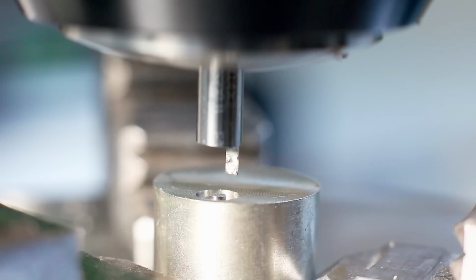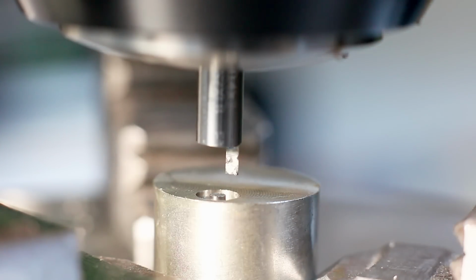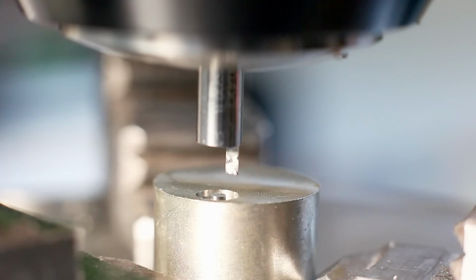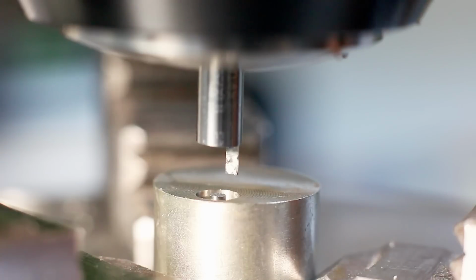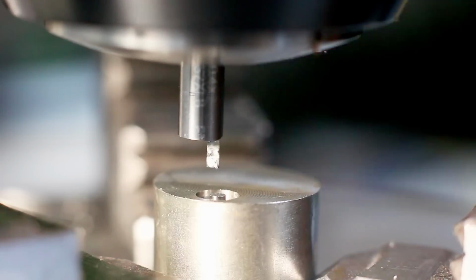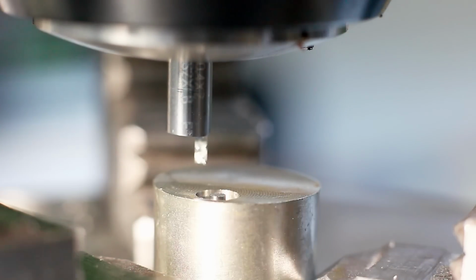This power feed is 10 microns per revolution, and to my liking is almost too fast. Unfortunately, that's the slowest feed this machine allows. But as you saw, it does a really nice job of plunging into the material. Let's do another one, maybe by hand feeding. Let's step over a little bit and do another one.